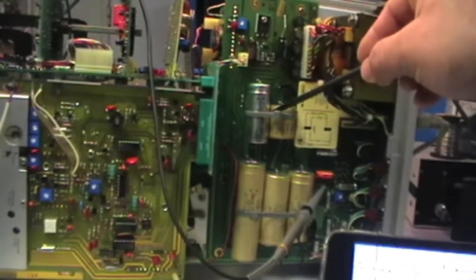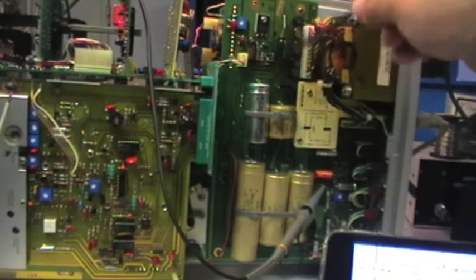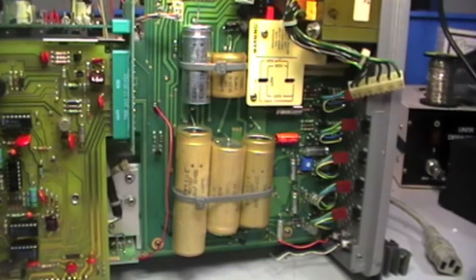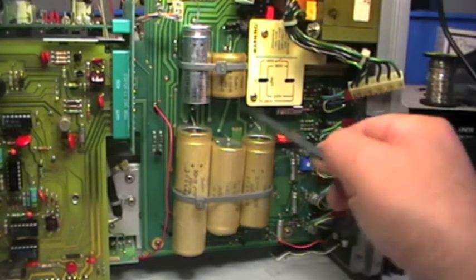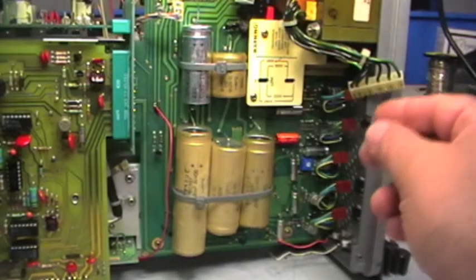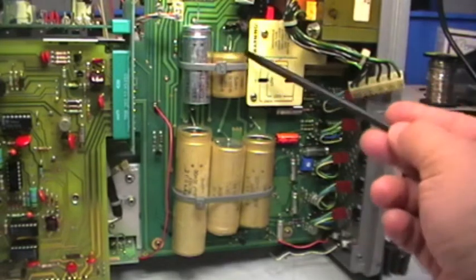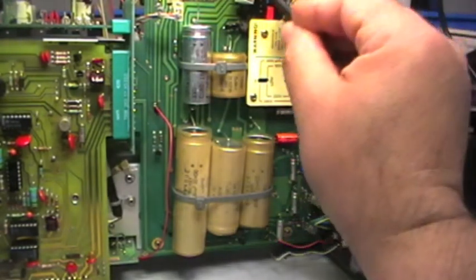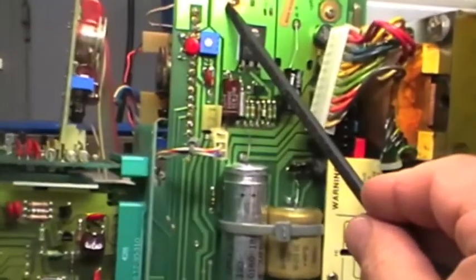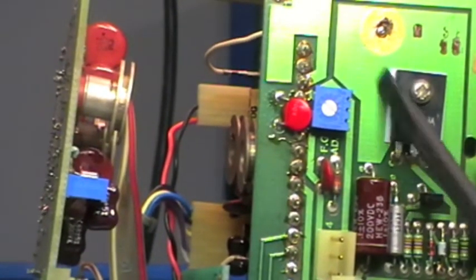So I will cut this strip and remove those capacitors, both. I would like to check them and see if replacing it makes some change. Well, this is what I have done. I have removed one terminal from the board of each capacitor, and actually none of them are very badly leaking, nor open. So this is strange to me. What I've seen actually is that here it's missing one screw. So I wonder if this screw maybe pulled to the ground something. Here on this side I cannot see anything.